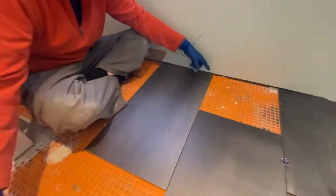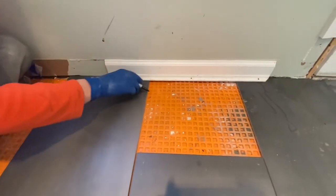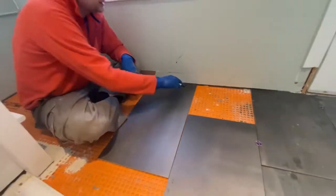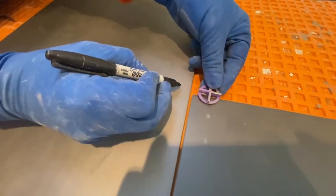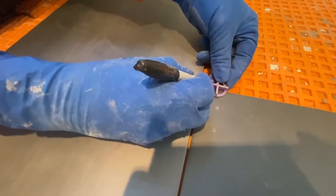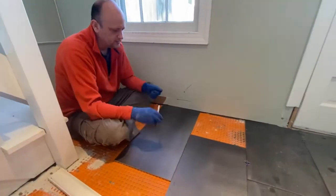I have a little bit of play on this back end because I have this molding here that will cover up quite a bit, but I want a nice tight fitting tile. So what I do is I set this up against the wall, I look at this space right here where I'm going to have the gap — I could measure this with a tape measure, but right there is where I want that line to be.